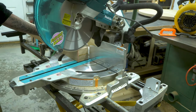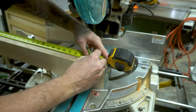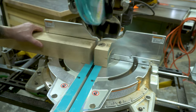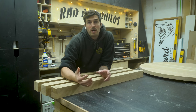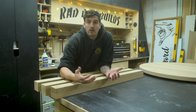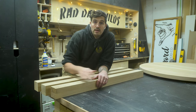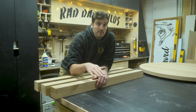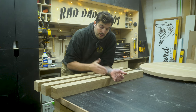I then cut all three pieces to 45 inches in length on my miter saw. You can change the dimensions to suit whatever style you want — thinner or thicker as you like. The 45-inch length is designed to create a dining table at a height of 30 inches; for a coffee table or lower table, obviously cut everything shorter. Now that everything's milled up and ready to go, let's start cutting out the middle sections to help the whole thing lock together.